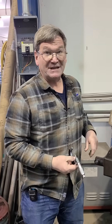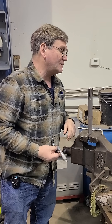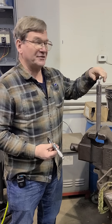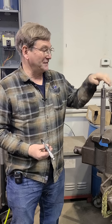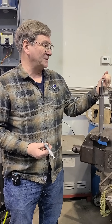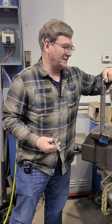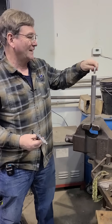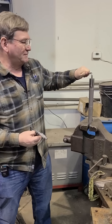One and 274 is way big. What somebody has done is expanded this reamer. Sometimes you do that in an emergency — they might have even used it on some soft material — but you're really only supposed to ever expand them and then regrind them. Expanding it as a trick to get yourself by is one thing, but expanding it and then selling it thinking it's still like a new one causes problems for the rest of us who use surplus tools.